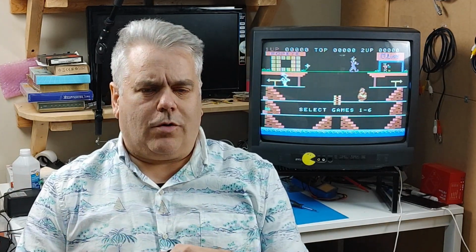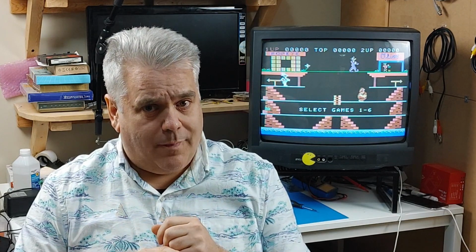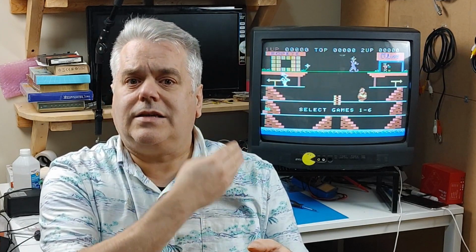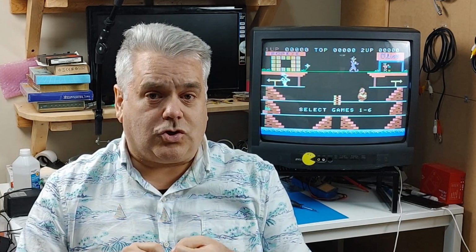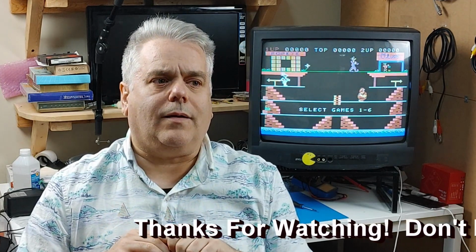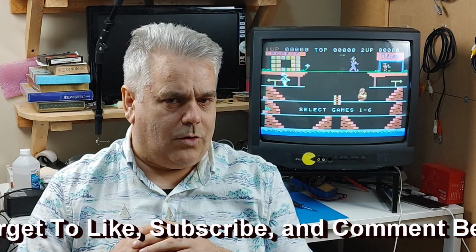It turned out to be a little bit more than I had initially thought. Initially, I thought it was probably one of the VRAM chips. I was right, one of those was bad, but there was also a bad trace. It's all fixed now, and as you can see, it is working. And one of the good things is that I have an extra one of those VRAM chips, which are a compatible chip to what I'm doing with the MSX computer right now. Yes, I am still working on that MSX computer. I have not got it going yet, but this leftover VRAM chip means that I have another part that I can test out in that computer.